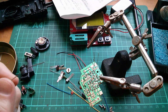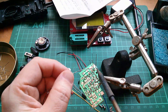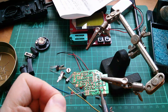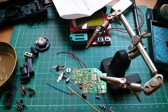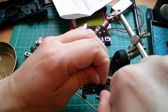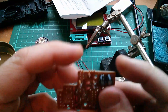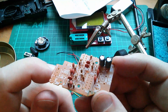I'm not sure if this has all been on camera — I think it must have been. Tricky to get to these. Flip that round a bit. There are the two big capacitors in, 100 microfarads. Not sure what the voltage rating on these are, but it doesn't need to be that high, because this thing runs off a 9V battery at 10V — not much of an overhead, is it? Probably wouldn't want to pump 20V through this thing anyway.